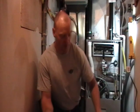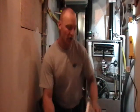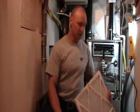We're going to talk about the basics of furnace maintenance. The most important and easiest part of maintaining a furnace is changing your furnace filter at least every heating season. Furnaces can't heat your home unless they can move air, and if the furnace filter is clogged, it generally causes the furnace to overheat and shut down.